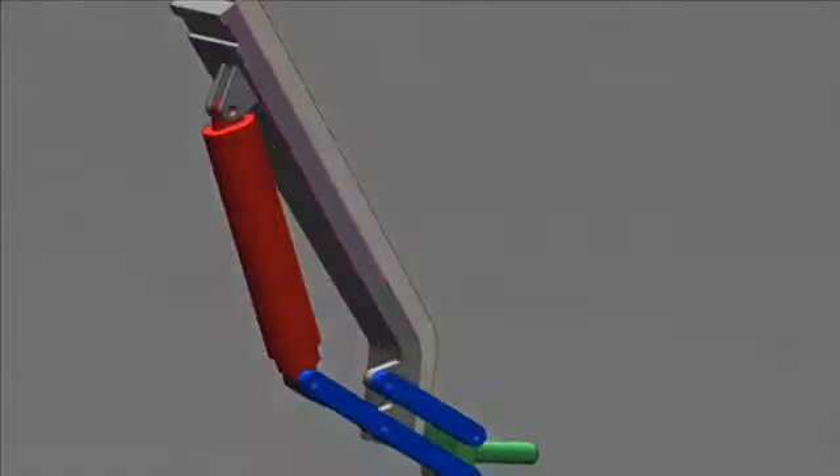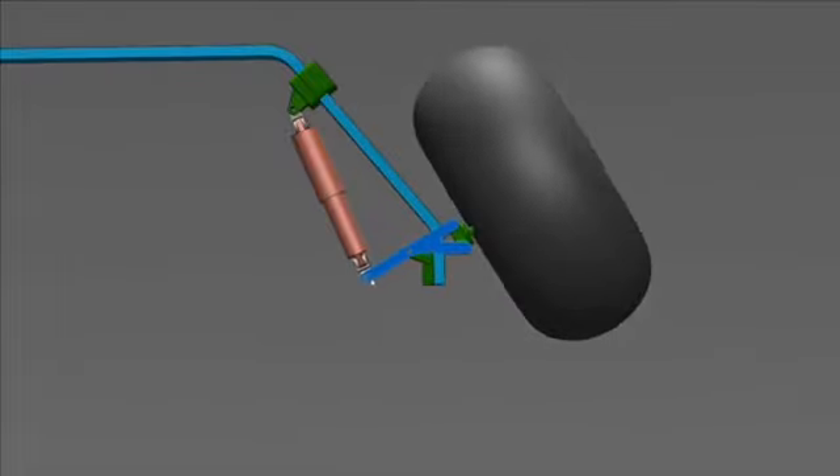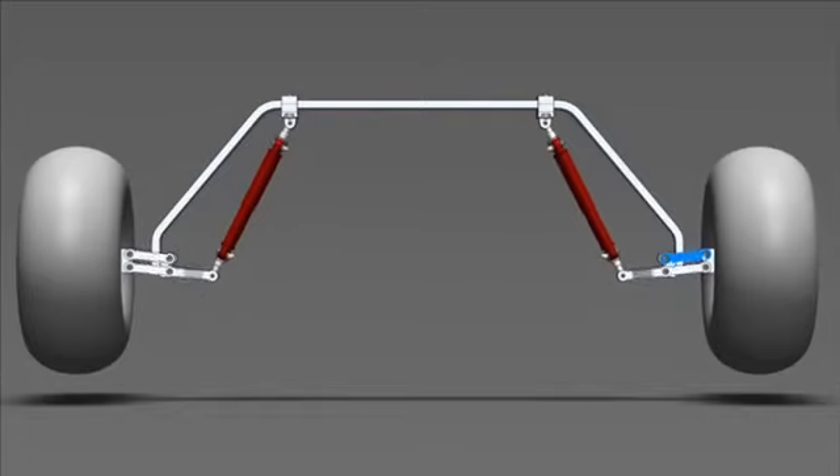Now that we have chosen where the shock frame is going to be mounted, we still need to overcome a few design challenges — where the axle is going to be positioned, and how the gear is going to move freely down. We came up with a linkage system where the axle movement is isolated from the gear. By isolating them, we get the best of the spring system and the best of the dampening when needed. The main issue with the linkage system is camber — the tilt of the tire when the gear moves up and down. This is an undesirable effect that makes steering hard while taxiing and creates excess wear on the tires. With the first linkage design, we were getting quite a bit of camber, which is what we were trying to avoid. In order to overcome that, we came up with a double linkage system, where it offsets the camber and creates a vertical movement, completely eliminating the camber issue.